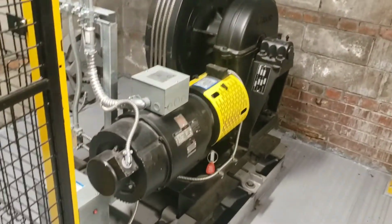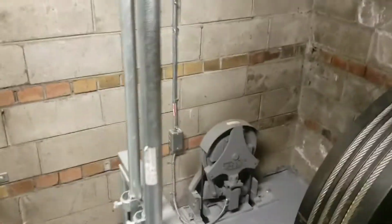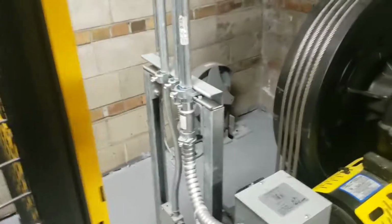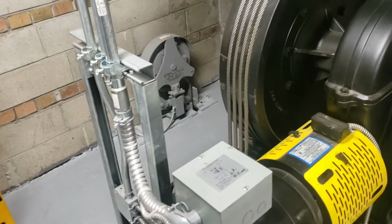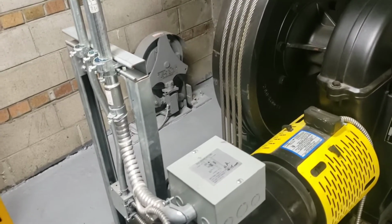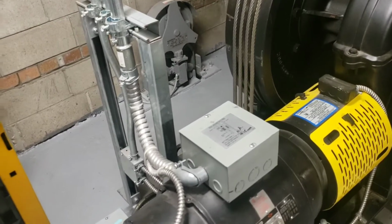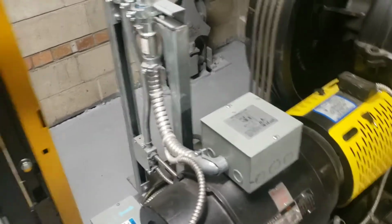The elevator pit was completely full of water, submerging the limit switch on this lift here, which was left shut down. TSSA had given us permission to leave this one on. We are, however, going to change the governor ropes on both units, starting with this one. But we're going to do the switch first and get it running, because there was a trapped passenger when it happened. So we're going to change the switch, see if it runs after that. Could have blown a fuse possibly, and go from there.